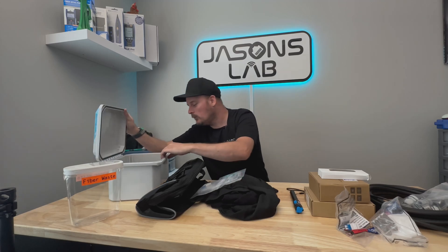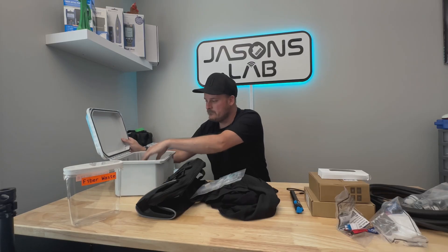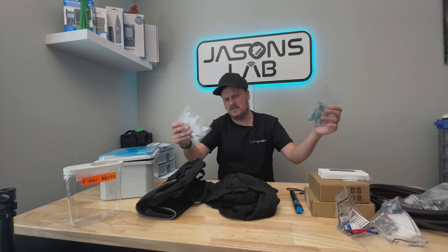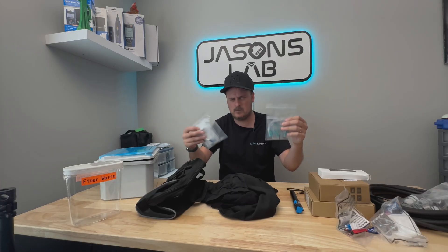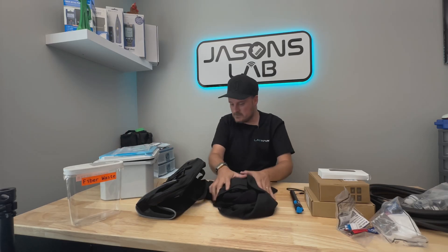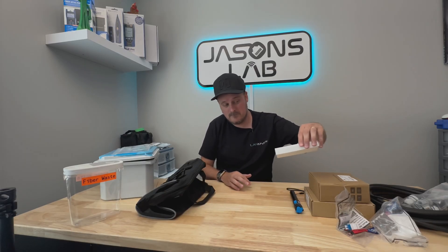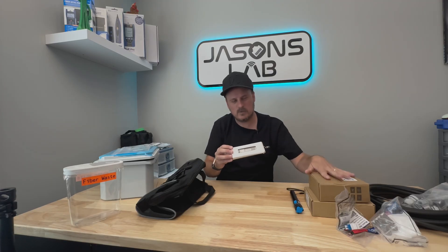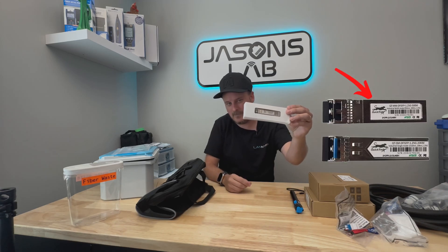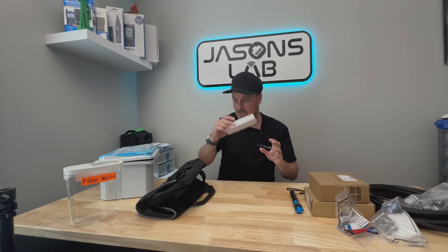In this case we have a piece of DIN rail that I have to cut to fit properly. This is going to go on the fence. We have our mechanical ends — he sent me others for some other cables, so I got multi-mode and single-mode. This is multi-mode cable, so we won't use the single-mode ones. He was also nice enough to send, just in case the switch didn't work with one of the modules, an SFP module to try in there — I'm going to try my other ones too, just in case.